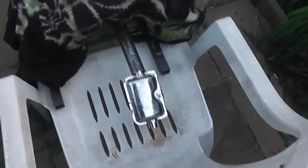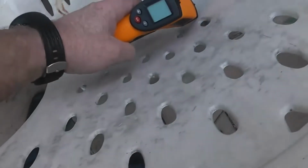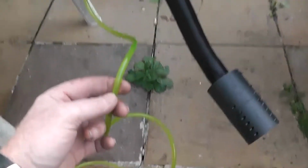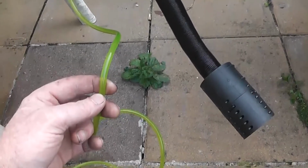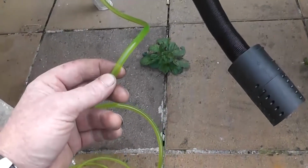Let's try the muffler. That's quieting it. Pointing at the chair. Probably going to melt the chair, but should we look to it? This green pipe is absolute rubbish, right? This is polypropylene, and it reacts to the diesel or whatever fuel you use, and it will go brittle and crack. I know this is just what came with it. Like, the one over there, I'm using high density polyethylene, you know, proper pipes. And as to 45 degree or vertical, I won't even go there, I don't care.